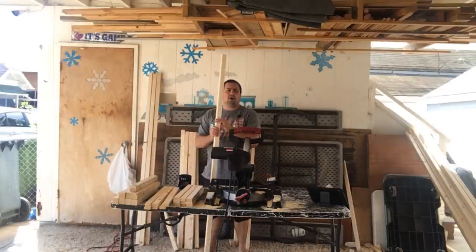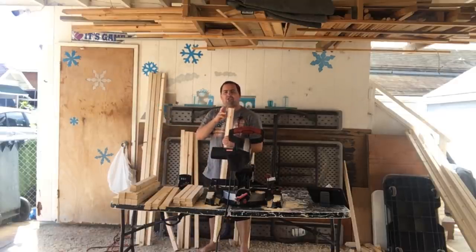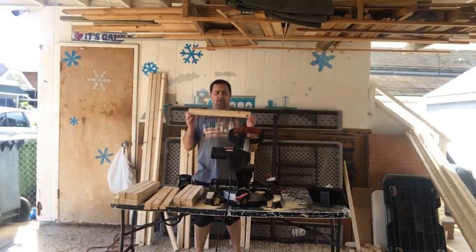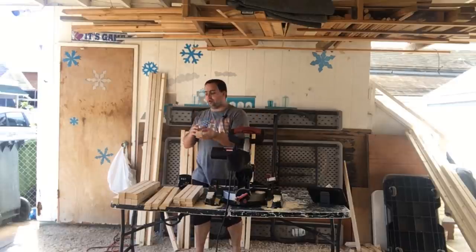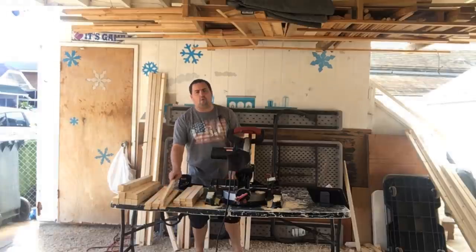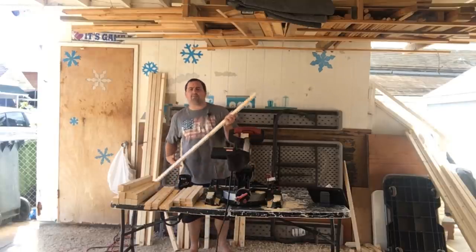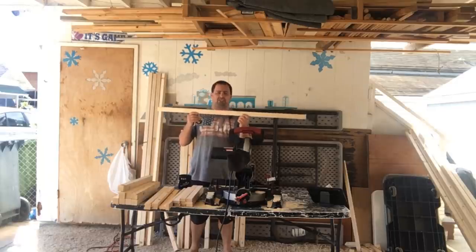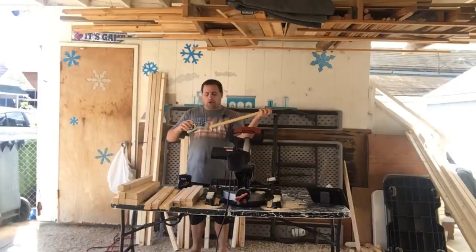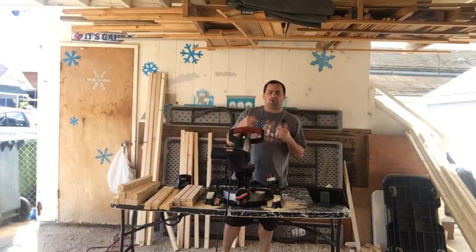You're going to need four pieces of two by two cut to six foot. You're going to need eight pieces of two by two cut to 47 and a half inches — this is going to be your left to right. You're going to need eight pieces of two by two cut to 19 inches — this is going to be your back to front. For the egg rollout tray you need six pieces of one by two cut to 23 inches, six pieces of one by two cut to 47 and a half inches for the front and back of the egg rollout tray, and nine pieces of two by one cut to 19 inches for the poop trays to sit on. I'll put all those dimensions down below.